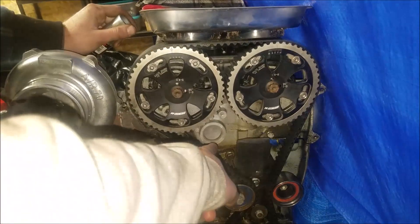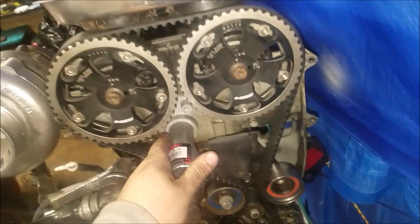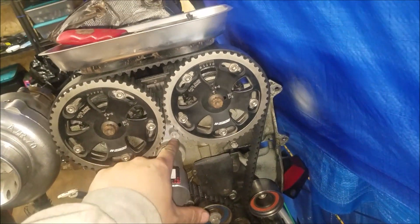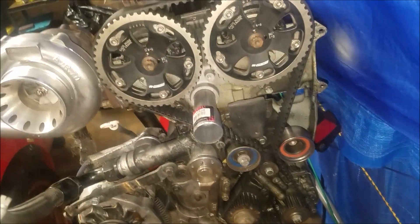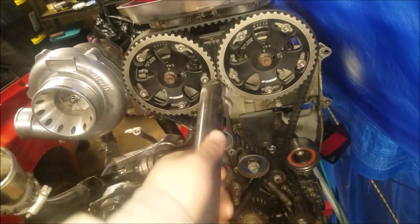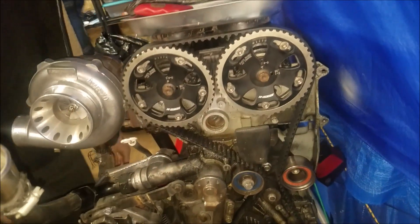This part is super snug — we're going to pound it in and then we're probably just going to make a tab to it because it's pretty accessible, then weld it to there. We've got this other piece and I'm going to cut it and weld it so it sticks out a little bit further, because this is too big — it's an inch and a half, and it's inch and three-eighths inside there, barely.